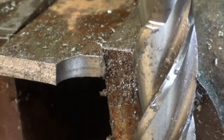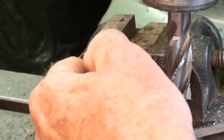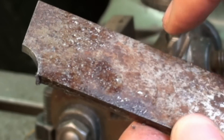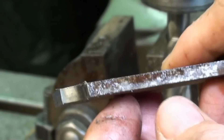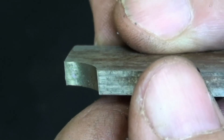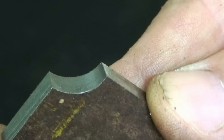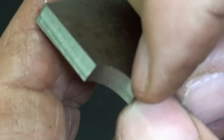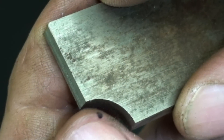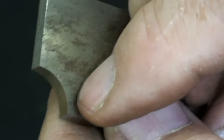And there it is — two or three minutes of milling, the rest was all setup time. It's ready to take out; you can see the angle. I'm going to cut this off a little bit so I don't waste too much material — this is kind of expensive. Make sure you use what amounts to precision ground flat stock, and this is oil-hardening tool steel. You can see the clearance from both sides. Remember, it's only going to cut right on that top little surface; the rest is all clearance, doing nothing but staying out of the way. You want it to be sharp there — don't file or do anything that might alter that cutting edge.